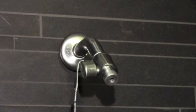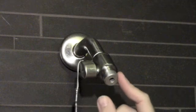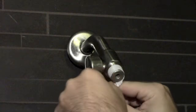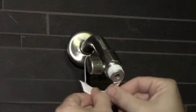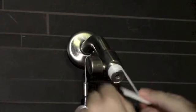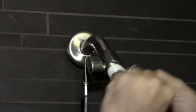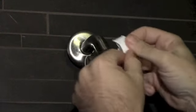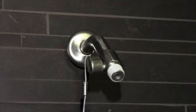Now I'm ready to attach the shower head. I apply plumber's tape to the threads instead of using a ring. We apply the plumber's tape directly to the end of the valve, just like we applied the plumber's tape to the end of the shower pipe. We don't use a washer here because we want to make sure we're keeping the valve free of any potential blockages. So just wrap that tape around to create a nice seal.